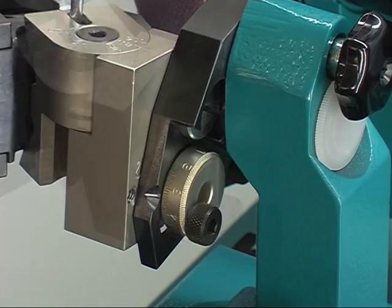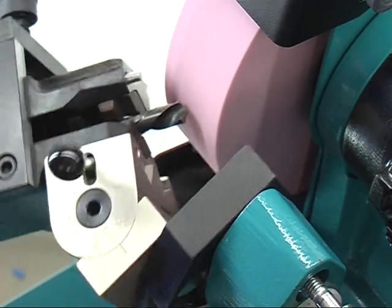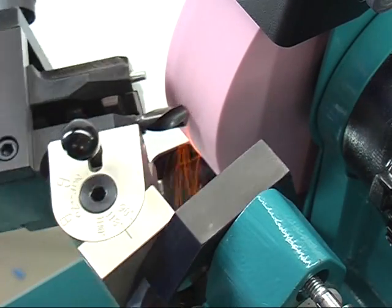The normal helix drill range is between 4.5 and 2. A higher number means less clearance angle and a low number means additional clearance angle. Now grind the drill during swiveling as mentioned before.